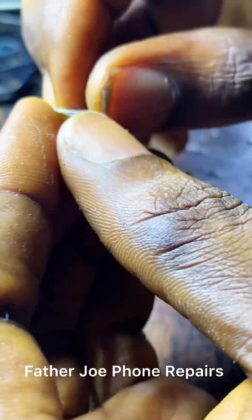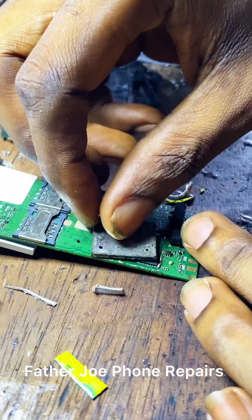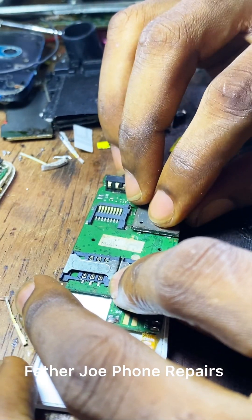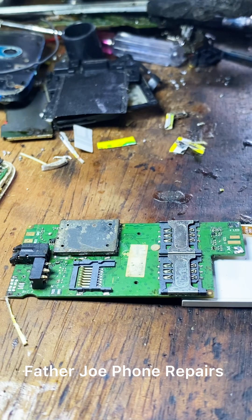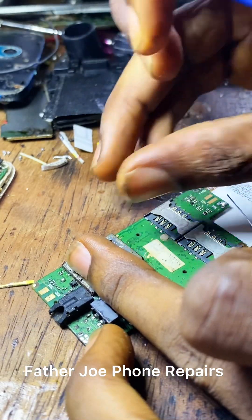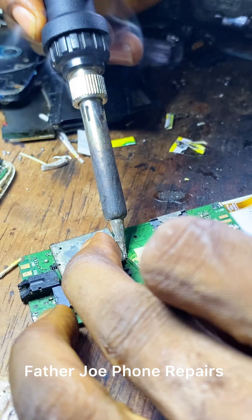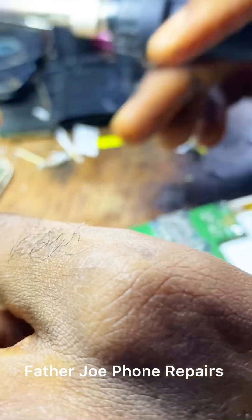As you can see it's a bit big, so remove one layer. Now let me test these two — okay, it's fine. Make sure that the paper lifts the heat sink. When you press the heat sink down with the lead, the paper will press the IC to the phone board so that the open circuit will now connect the wire and the button will work. Be very careful and take your time with this — no rushing.